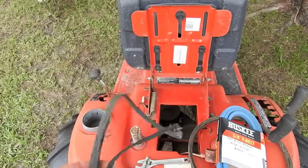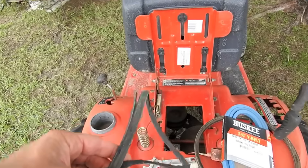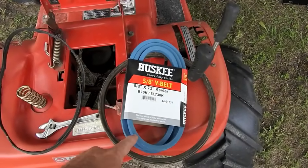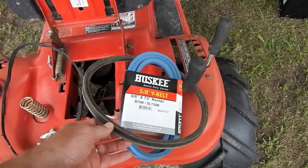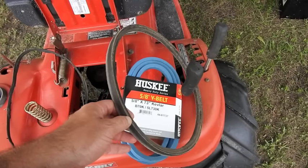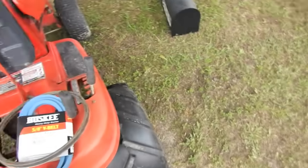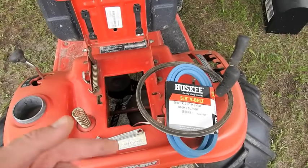Going wide open, the back belt — I smell a little bit of rubber. It shredded the back belt, one of the dry belts. I had to bring down the rollback for Troy — shredded a back belt, too much speed. It's okay, we got a new belt. I just bought a new one — this one's an inch longer, 73 by 5/8. And this is a 35 by 5/8 that I borrowed off of the Yards Machine. I'm guessing maybe the 72 inch was too tight and it shredded the little belt, so we're gonna try 73 and 35.